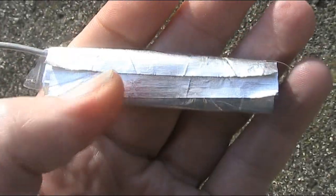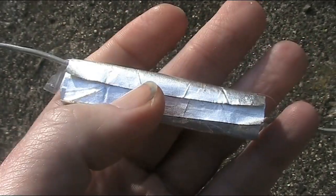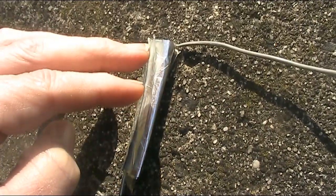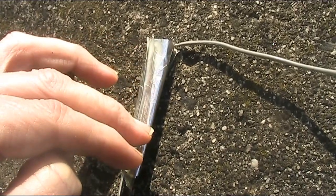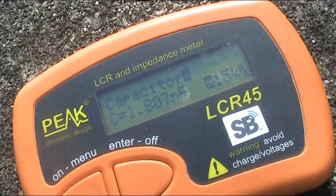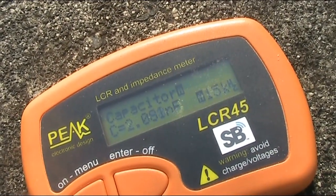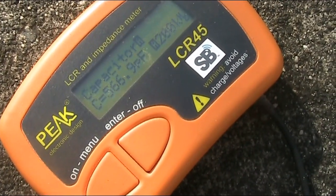Just wrapped some tape to hold it. There's still going to be a lot of variability with this, but let's measure the value — we're getting 351 pF. I only put one bit of tape around the middle. I'll now tape it up a bit more so there'll be more pressure and likely more capacitance. Now I'm pressing it hard and we're getting up to 1.8 nF — in fact, over 2 nF. Now I've lessened the pressure and we're back to just under 600 pF.